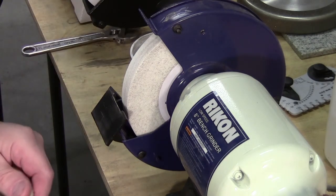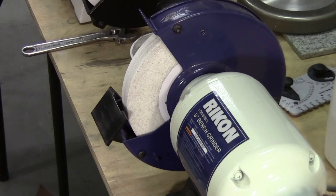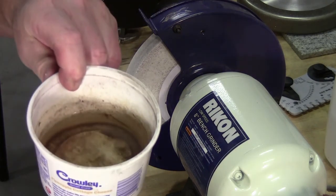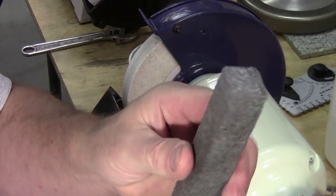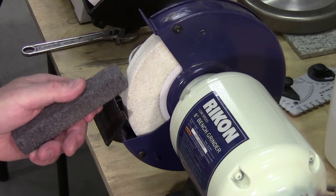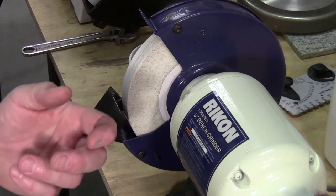What would we need? I've got a rag on my lap so that when I'm grinding I can wipe the blade. I also have a little dish of water — regular H2O — to keep the blade cool. Another thing: if you have a bench grinder, you may need a dressing stone or a diamond dresser to flatten and clean the stone while it's spinning. That opens up fresh abrasive so you can cut faster and cleaner.